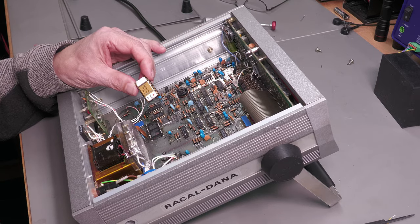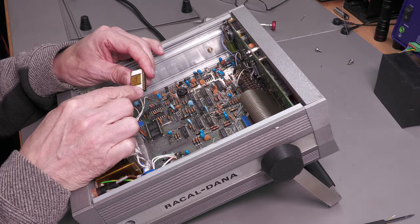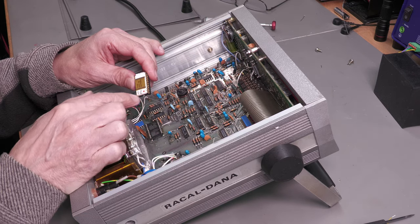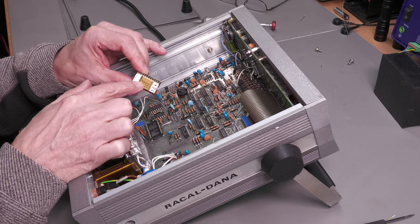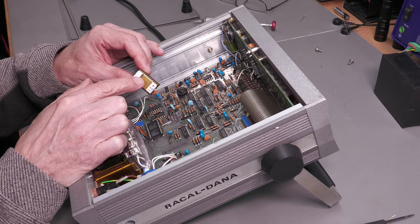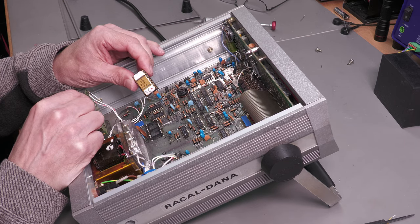Well, before I actually refit the IC, still got that niggling doubt that that's not pin one at this corner here. I did look online and I found some photographs of a different unit and somebody had actually put a black mark in the corner, but this corner, where the text is readable. Now I'm going to go back old school here. Basically, you orientate the chip so that you can read the text, and bottom left hand corner's pin one. So I think I'm just going to go ahead and try that.